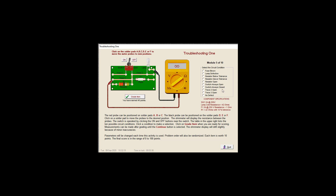So I guess our resistor is in spec. We've got 29 ohms — 30, perfect. Let's check trace 2 — good. Let's check our switch — good. Our resistor is 9.6 and it should be a 10 — that's good. So let's check our fuse. Our fuse is no good.